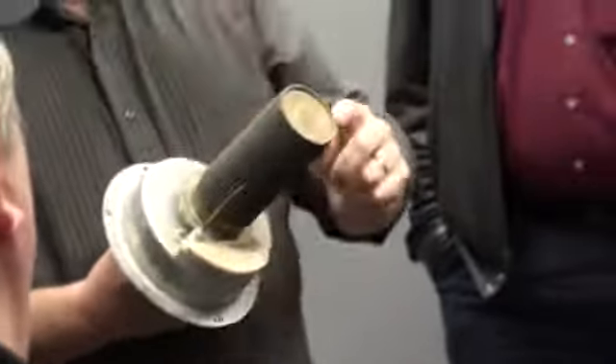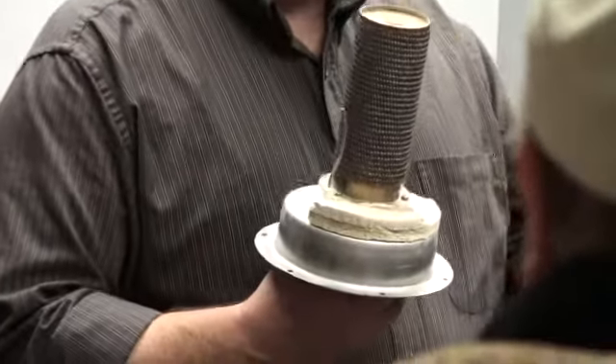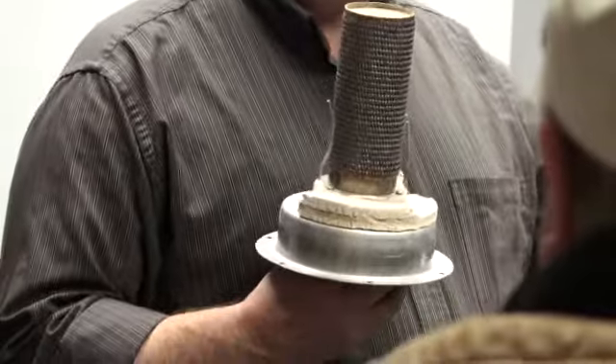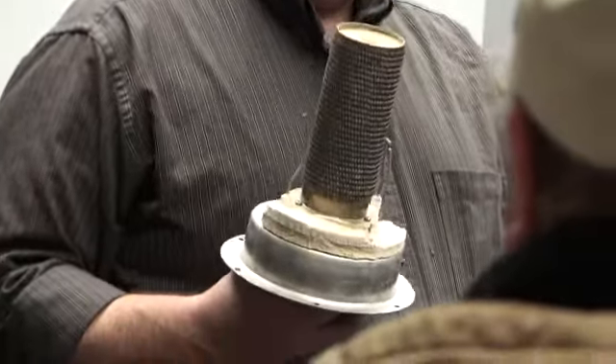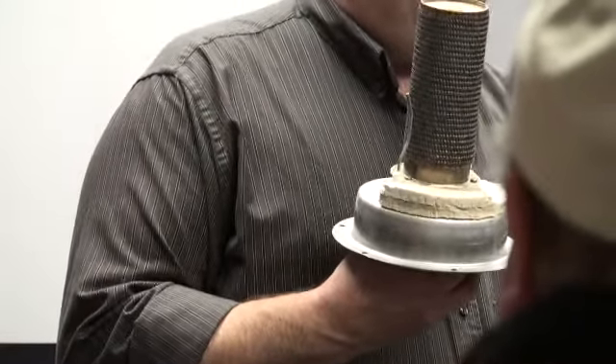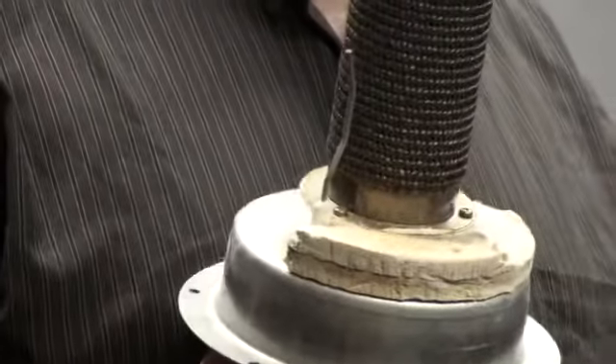You should never see any rust stains on here. If you see water rust stains, chances are you might have a leaking heat exchanger. They have one they put in four months ago and went back getting error codes - they pulled the burner out and had a bunch of big white chunks of calcification inside. Typically when that happens, we have a leak inside that heat exchanger. You won't find a leak on a leak test because it's a hairline crack that doesn't leak until it heats and expands, opening the crack. The white calcification comes from water escaping as a very fine mist that gets heat from combustion and creates white calcification chunks inside the machine.